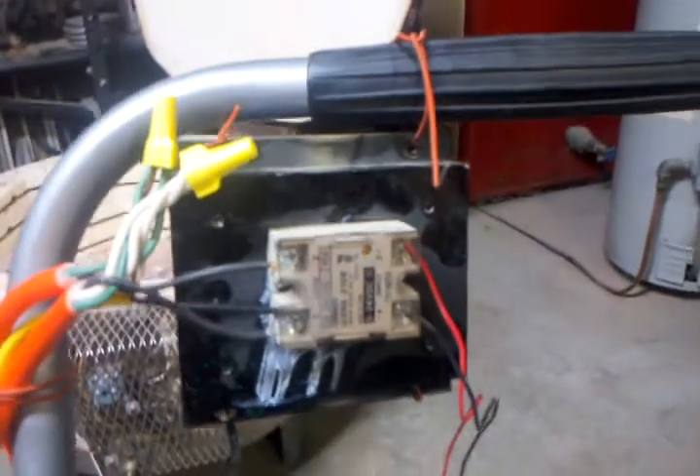I'm firing my kiln off of a solid state relay, with a big old heat sink and a computer fan on the back to keep everything cool. There's my thermocouple — you can see that right there sticking in. I'm going to load her up with some flint.